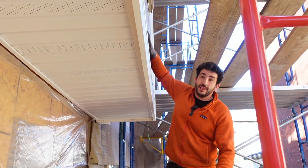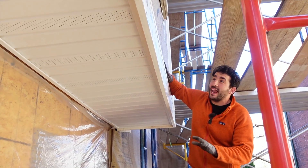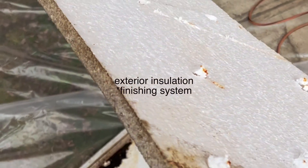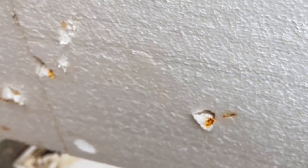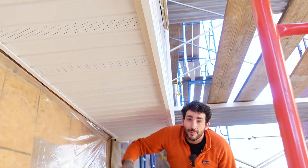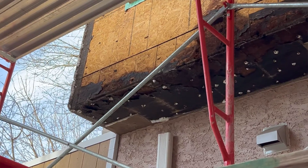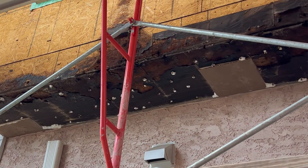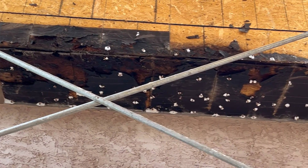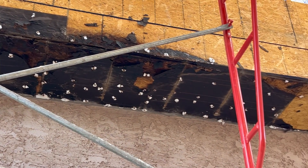Any change of plane that you have should have a really clear way for water to get out. Originally, this bay window was clad in stucco — actually clad in EIFS, exterior insulation facade system. Similar principle. It came down vertically and then returned underneath. What was so problematic about it was there was no way for water to drain. Water got trapped in the system, entered the system, and passed through the wall via condensation. It needs a way on this lower plane to drain out.